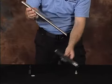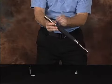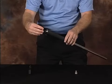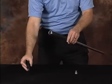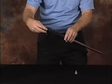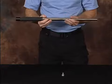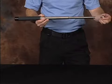Now do the same with the handle tube, making sure that the tapered end goes in last. Next, replace the anti-rattle ring — note that it has a beveled, tapered edge and fits perfectly in a pre-designated cutout in the base of the handle tube. Follow with the retention end cap and thread that fully. Prior to replacing the extended end cap, place your baton back into the vise so you can apply red Loctite and secure the extended end cap.